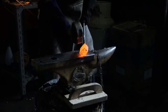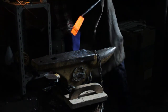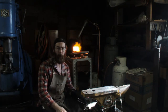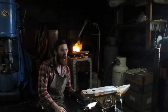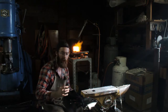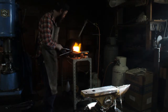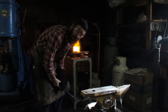Now I'm going to draw the billet out with the power hammer. I need to make sure I work evenly on both sides so that the core steel remains at the center. I've got it all drawn out — I've gone for a bar size where I can either forge more pieces out or just stop and remove the blade. I might stop and rough in the blade tonight just to see how it turns out. I'm trying to bring the bar up to a heat to normalize it, but it's too long to fit in my forge, so I have to heat each end in turn and let it soak down slowly. It's just a smidgen wonky, but at least it's flat.